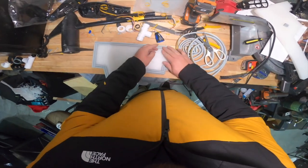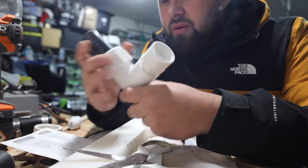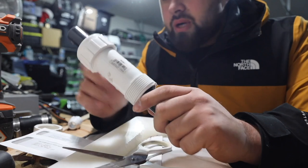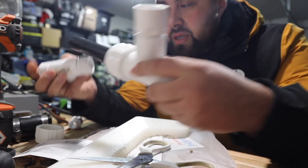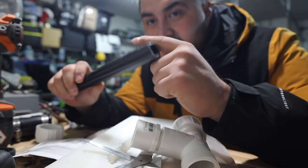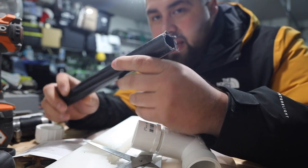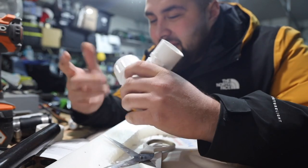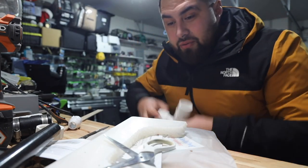We just had a breakthrough idea. I went with a one inch compression fitting and when it's tightened down both sides it can still be moved around. The issue was the three-quarter compression fitting would just not fit. The idea was to get a three-quarter compression fitting but it just does not go on. I figured I'm just going to wrap the entire shaft with some black electrical tape so it becomes wider and the compression fitting can grab it.